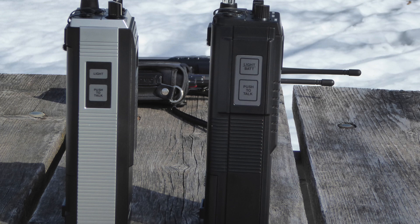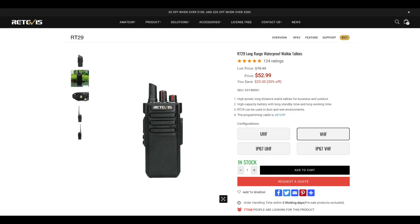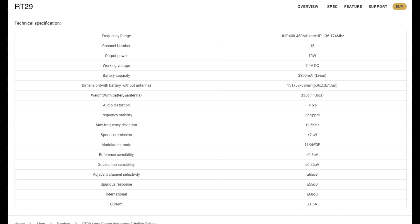These models are nearly identical aside from the case design. Both feature 4 watts output and offer 40-channel AM functionality. I decided to produce a video comparing these two units to two 2-meter handhelds in a simplex range test. I grabbed a pair of Retevis RT-29s I had purchased a couple of years ago. These HTs are essentially dumbed-down 16-channel computer-programmable radios, set to 5 watts output for the test, as there is no 4-watt setting. These 2-meter rigs are analog FM only.